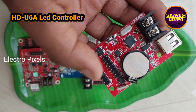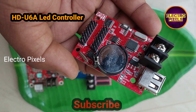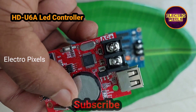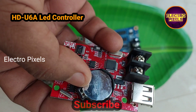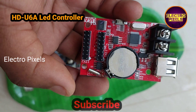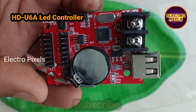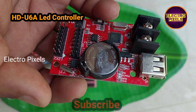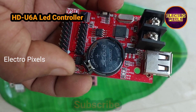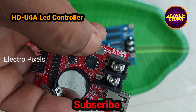The loading capacity of the U6A module is 320 x 32 pixels and it has two HUB12 ports, meaning it can work for two lines of HUB12 modules. It's uniquely designed with a USB port and it's more efficient and stable. The operation is friendly and easy for the end user — just update and send program content by U-disk. The U6A can display text, time, animation, and other contents, and it also supports richer display effects with background and bound frame functions.